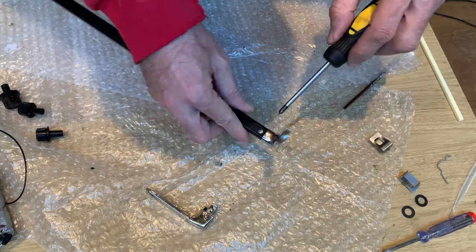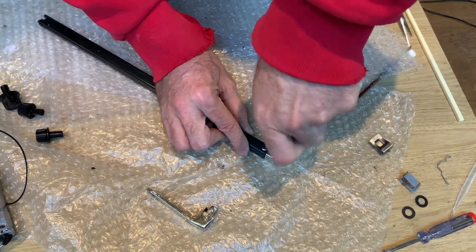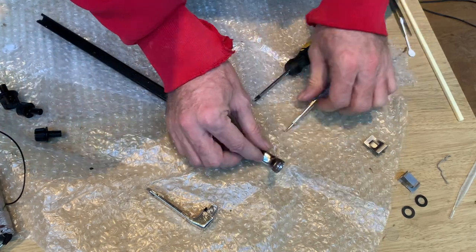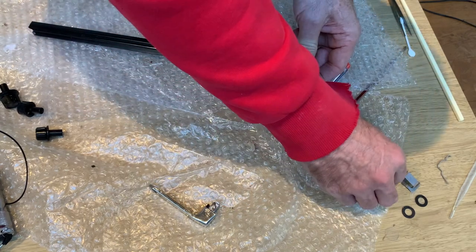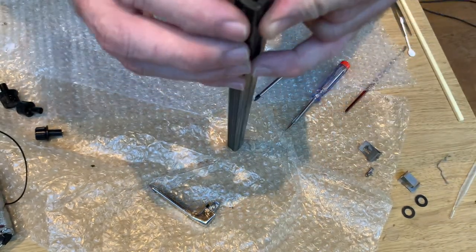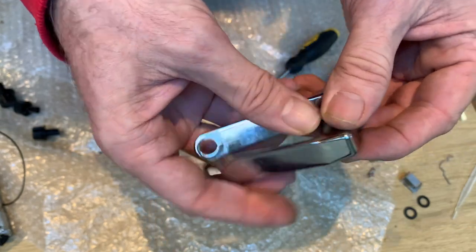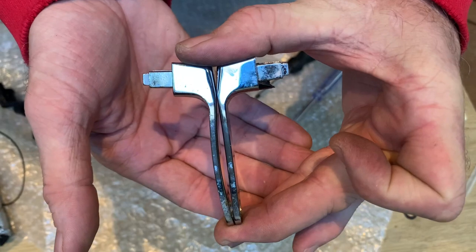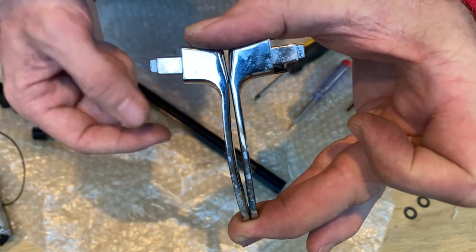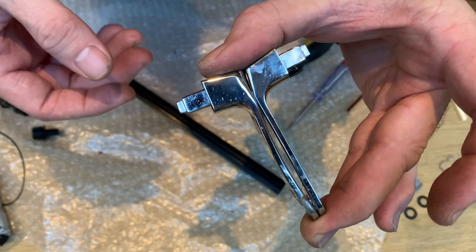This one, on the other hand, needs to be bent back into shape. We shall go ahead and get that out. So there's a tiny bit of repair to do just on that extrusion. Basically the main thing we want to do now is bring them both into view together - this is the correct one, it's flat. This one arcs around and bows, so it needs to just be gently squeezed back that way, and that should only be a little job in a vise. I'm going to go and press that in a vise with some cotton or something around it just to squeeze it back into shape and I'll be right back.